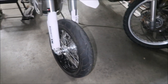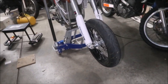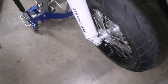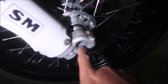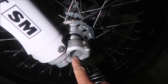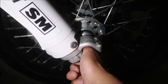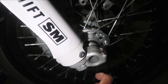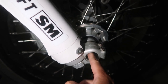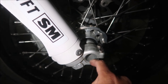Here's the front of the bike — that's where we'll be focusing. I'll put it on the stand so it's easier to work with. We're going to stick a threaded rod through here and put wheels on it. The axle is hollow — big enough to stick my thumb through. So we've got to make up for that. If you just stick a threaded rod in and the bike goes down, it's going to flop around. You want to take up all that slop.